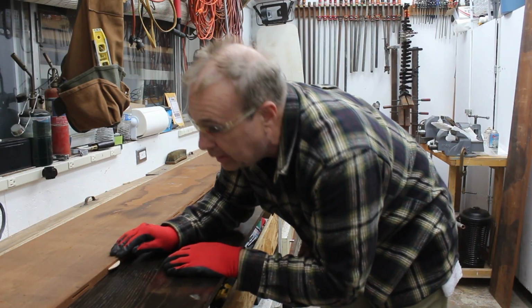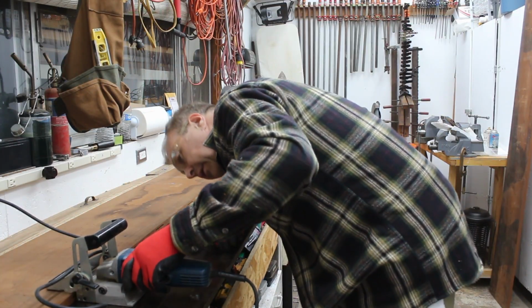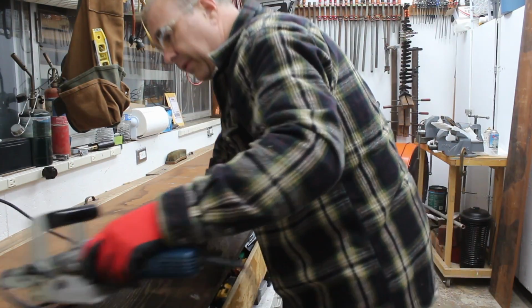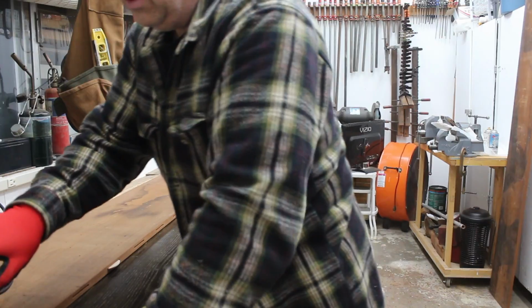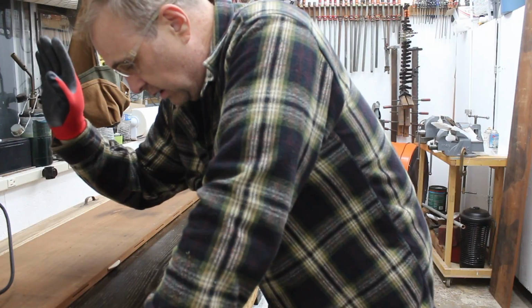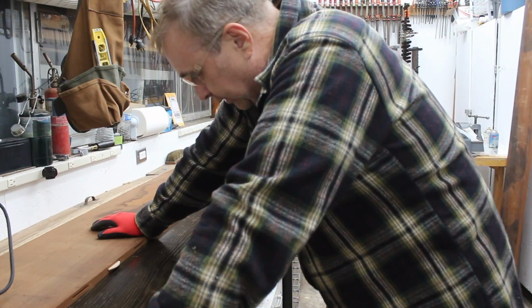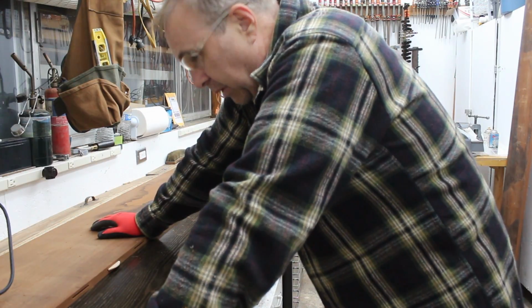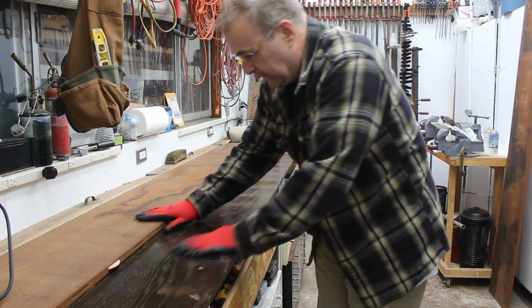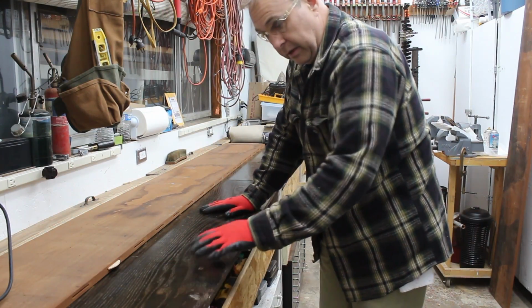I was pushing down each time, and I had this brace set so that it'll be relative to this bracket and not to the bench. In one video I watched, the guy said he doesn't even use this bracket. He just leaves it at the top and doesn't even use it. But I thought, this thing is not exactly flat. I mean, it's got just a tiny amount of flex. But I figured it'd be better to have this be at a fixed position so that the slots will be relative to the top surface and not relative to the flatness of my bench. My bench is very flat all the way down.